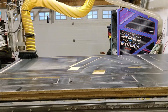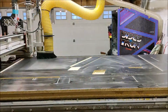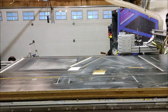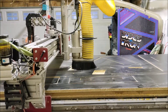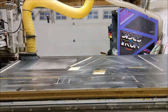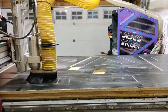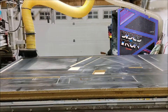Here is my first mistake of the night. After I ran the first toolpath for marking the holes and put the screws down, I didn't bother to re-zero the tool height. Basically what this means is that the tool height was too high — as we screwed the wood down, it got closer to the spoilboard. When it went through into the CNC cut, all of the cuts were too high, or not deep enough into the wood. As a result, I now get to re-run the cut a second time to make sure I have the depth I need.